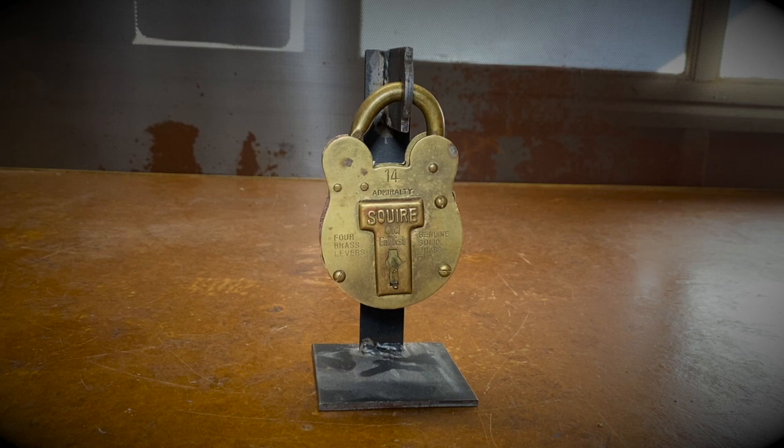The first one was a lock I made for Bonnie and Clyde. There's a scene where the actor was going to shoot off the lock to get into a gun cabinet to steal guns from an armory. The director didn't say he wanted anything to happen to the lock — it was just going to be a flash — but I came up with the idea of making the lock kind of drop down. I got the lock, put a little servo motor in there, hid all the electronics inside the lock. I was able to put the battery on the outside in the back because the audience can never see it. I'll show you how it works.